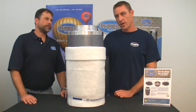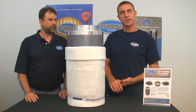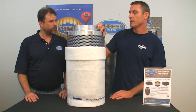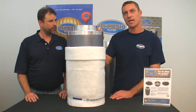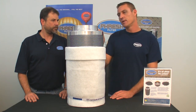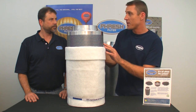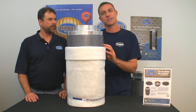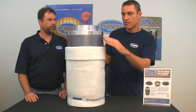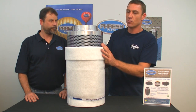We actually use a tuned frequency vibration table to pack these filters. Our engineers have worked out the exact frequency to vibrate and pack these to make sure we get a completely full packed bed. We then use an inch piece of foam which is compressed down to less than a quarter of an inch to make sure any movement after packaging is taken up by the foam. Generally if you pop the top of one of these you'll find it absolutely packed. We've pulled some competitors to pieces recently and found their beds nearly verging on the lip — that's a very bad thing. Air will try to passage through the least path of resistance, and certainly that would be the foam. So if you don't pack these things properly you will get failure.